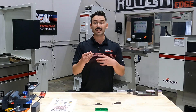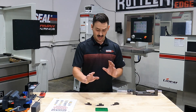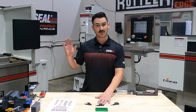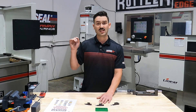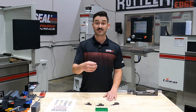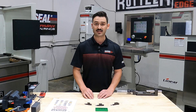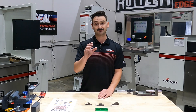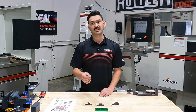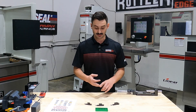If I need a blind hole, I'd look for an RT322. So I've got all three inserts here along with our boring mic, and we're going to hop in on the F10XS — our CNC boring and surfacing machine. I've got an LS block loaded in it, and we'll take a couple of cuts at various feed rates to show the differences in how you can program. One of the nice things about CNC machines today is infinitely variable RPM and feed rate — you simply type it on the control. This lets you really dial in and optimize your feeds and speeds, giving you the best tool life, productivity, and results.